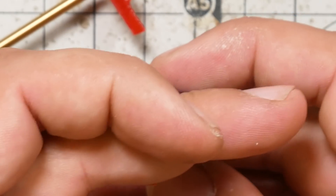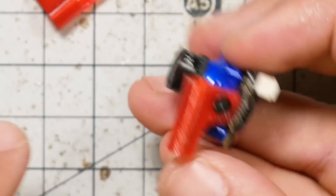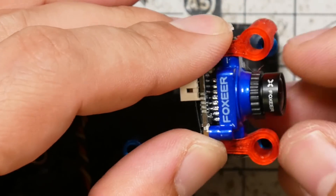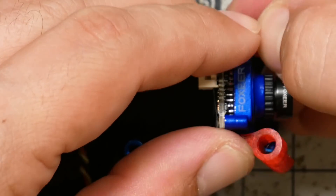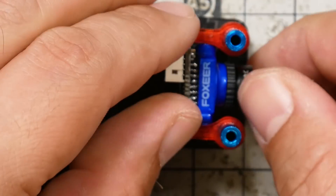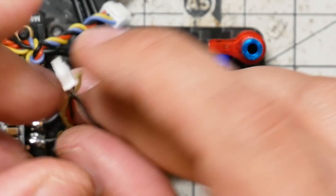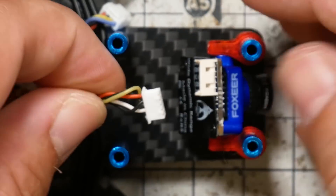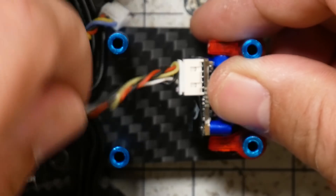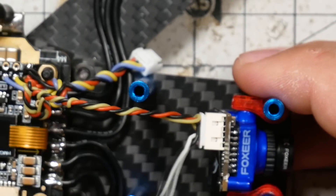Wait — I've done this backwards. Can you see that if I install it as I was showing, the camera will be pushed forward? We want the camera pushed backward. There we go, that's how you want it. With the 3D-printed brackets installed, we can just push that over the front standoffs. Push on the bracket, not on the camera — it's not that strong. And there we go, that's how it's going to mount. At that point we can plug in our camera. I'll just twist that up a little bit to take the slack out, and the camera can get plugged in. And that's going to bring us to the end of this step of the build. Check the playlist down in the video description to go to the next step, or it'll even autoplay for you. See you there.